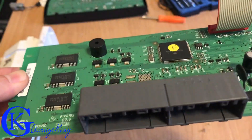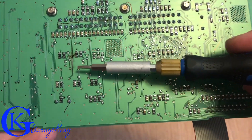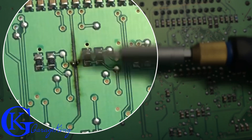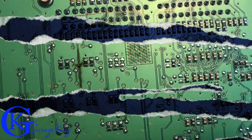Here's a good look at the circuit board. If I flip it over, you can see it's burnt right there — I guess there was too much current, the hot water valve shorted out and caused that to happen. So what we're going to do is solder in a jumper.